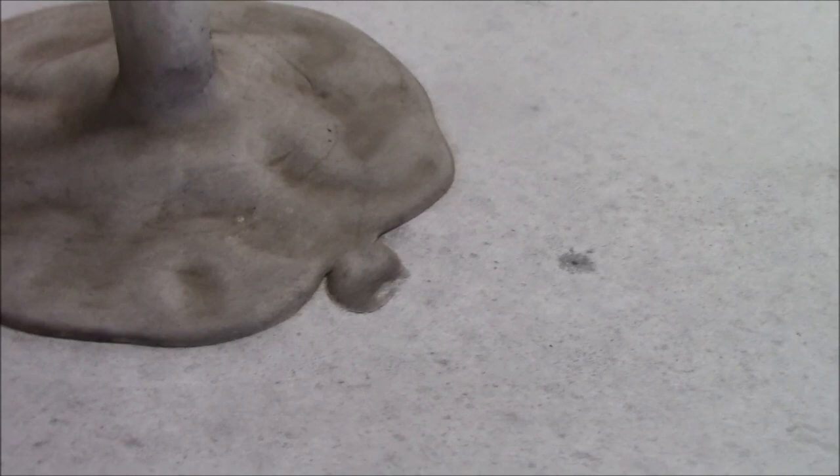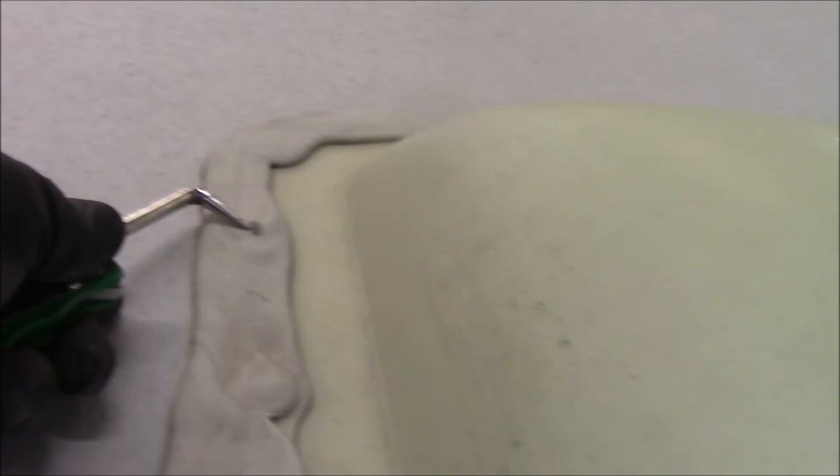We're gonna put boots up on this thing — we don't put them in like that. After a while when this thing wobbles around it tends to want to breach around here and then you end up with some leaks in there and it'll start rotting out that whole area. We don't want that. We put them in boots. We've got our skylight, same way.